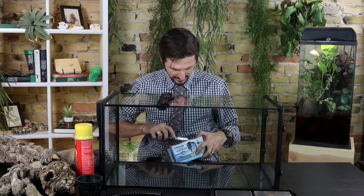First thing, I'm going to need to get this pump in place. I've learned from past waterfall builds that you want to make sure your pump is somewhere you can access fairly easily. Otherwise, whenever you have problems with your pump, and you will have problems with your pump at some point, you can be in a lot of trouble. So I'm going to try to put the pump somewhere where it's not too conspicuous, but where I can get to it if I need to.